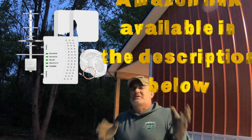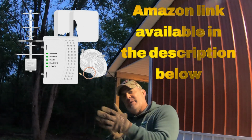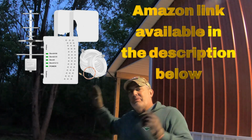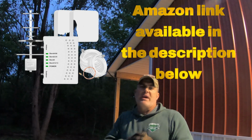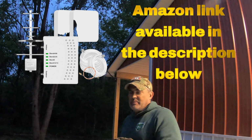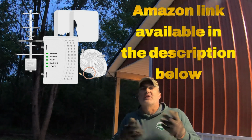In order to make this successful, you have to do trial and error. You have to get the thing set up and then kind of position it to where you get the best signal. That's going to give you the most success. Placing the antenna is by far the number one thing that's going to make this work for you, to get 3 or 4 bars to make this successful. So I did a lot of trial and error today and I've got it up there, but you definitely want to see where the best position is to get the most bars.